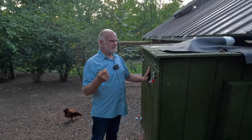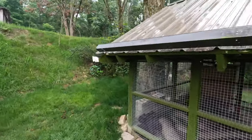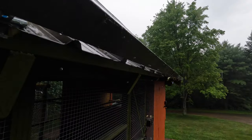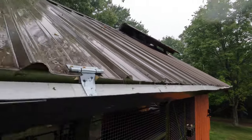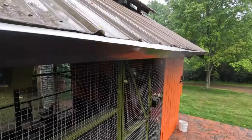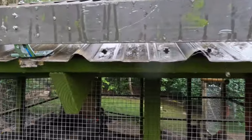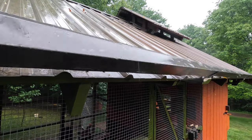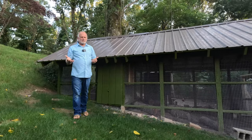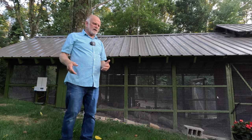I set out to change the gutters to something I can clean easily. The first gutter system was one that flipped up — I put the gutter into use and it works. When I have enough water I just flip it up and it won't catch debris that sits there and rots to make brown water. When I want the gutter operational I bring it down and it catches the water. It worked pretty okay, but it was too clumsy, not very rigid or rugged — I didn't think it was going to last.